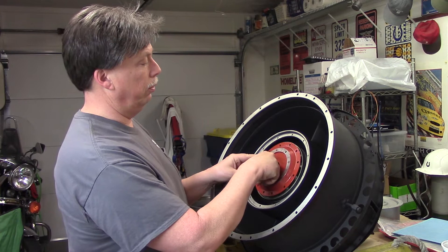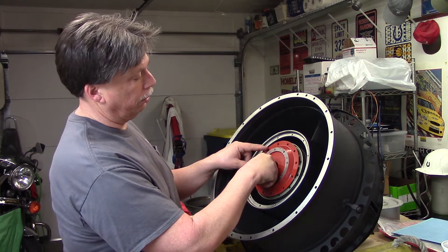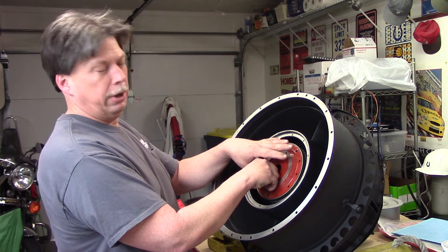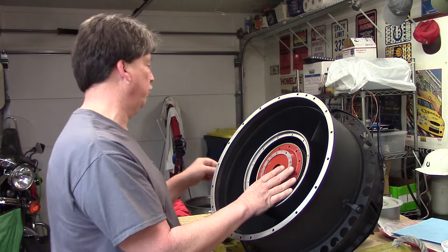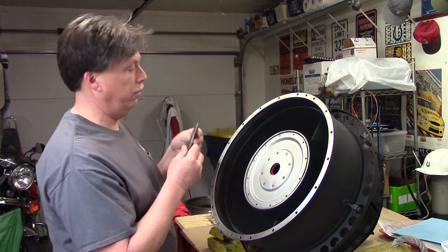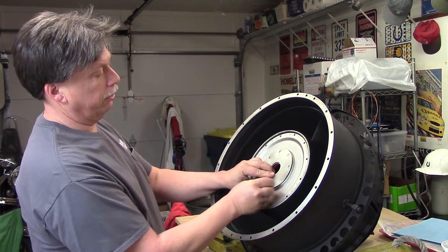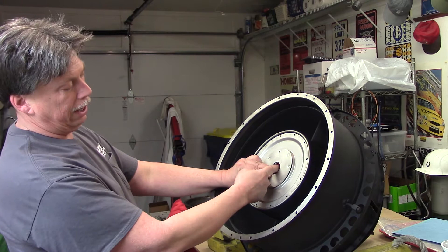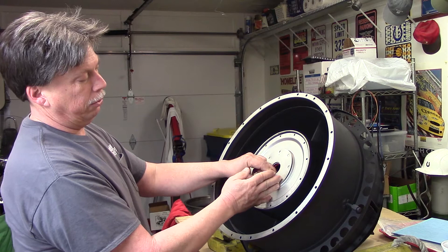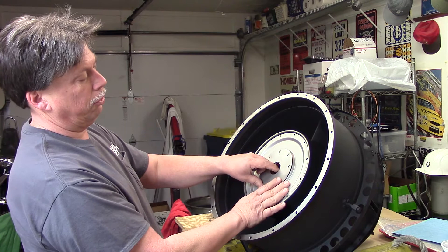Then there is the bearing retainer. It installs over all that and is indexed — these holes only line up one way. This holds the aft end of the rotor shaft assembly. Then over all this we have covers, enclosing that bearing and keeping it shielded. We also have a ring and a baffle. Air is pressurized and allowed to leak out around where the shaft goes through. There's a tiny clearance allowing a net flow of air out, which keeps the bearing cool and allows some cooling air to form a layer along the back of the turbine rotor.